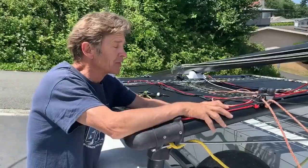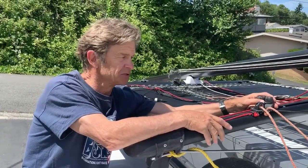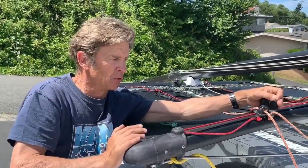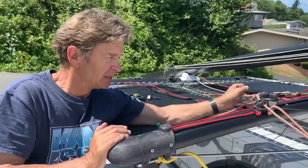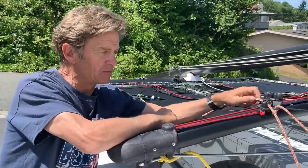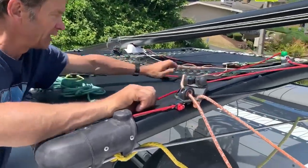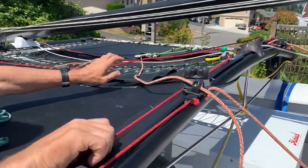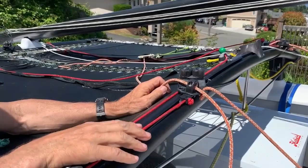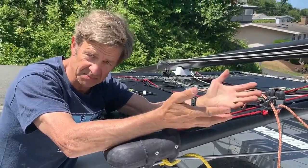If there's only one or none, you can add them, you just have to add more to it. The older boats had a mechanical traveler return system where you'd pop a button and the crew would run them out. Back in the 80s or so, Trend Tech came out with an aftermarket system — now it's standard to have a remote system. We run this over to the other side and now the crew can adjust from either side of the boat, which is pretty important. Again, you can retrofit it, but it costs money.